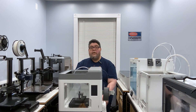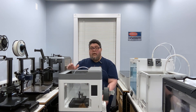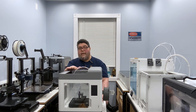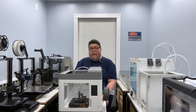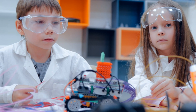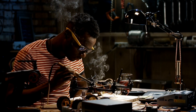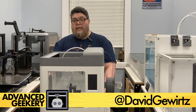So, do I recommend you buy this? The price is a lot more than other printers with bigger print areas. That said, you do get a lot with the product, including the webcam. Also, the entire frame is made from plastic — I'm not sure how long this will last. Another concern about product life is the build platform, which is supported on only one side, so whenever you remove and snap in the magnetic plate, you're applying stress to the platform. If this is intended for schools or kids, I'm not sure it's robust enough to handle the inevitable abuse. For hobbyist use it might hold up, but only time will tell. What do you think? Is this a printer you'd like to use? Let us know in the comments below. My name is David Gewertz — go out there and make it awesome!